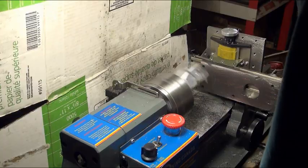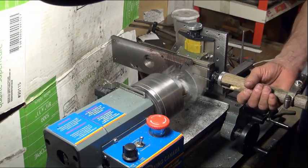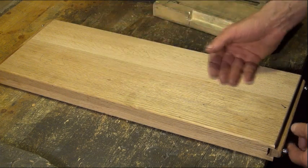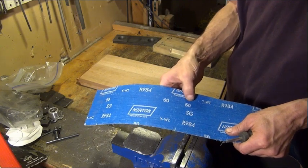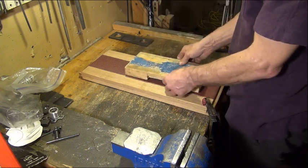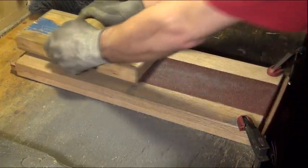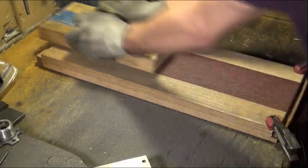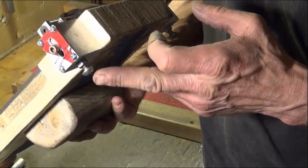The surfaces were still rough, and I needed to smooth them out with a fly cutter attached to my lathe, but the lathe was too small to go through everything in one pass and they were still rough. I needed to sand them down. A friend of mine, Fabian Jennings, made me a sanding board, and I made a shuttle that would hold the blade loosely and use some coarse sandpaper. There were a lot of problems with the blade ending up convex because of slight rocking in the shuttle and blade, and also some uneven wear in the sandpaper. So I ended up putting solid anchor screws holding the blade to the shuttle.